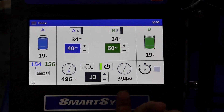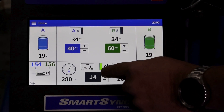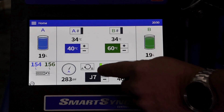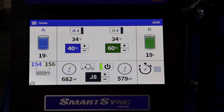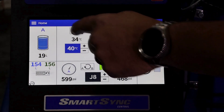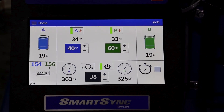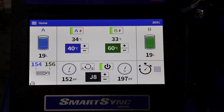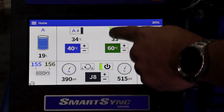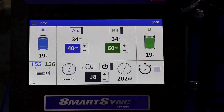We can see the pressure of part A and part B. I can increase the jog cycle to move material through the pumps quicker. This is the point at which I would turn on part A and part B heater in order to get the material up to precondition temperature prior to spraying. When we stop the jog cycle, I will turn heater A off, heater B off, and turn off the jog cycle.